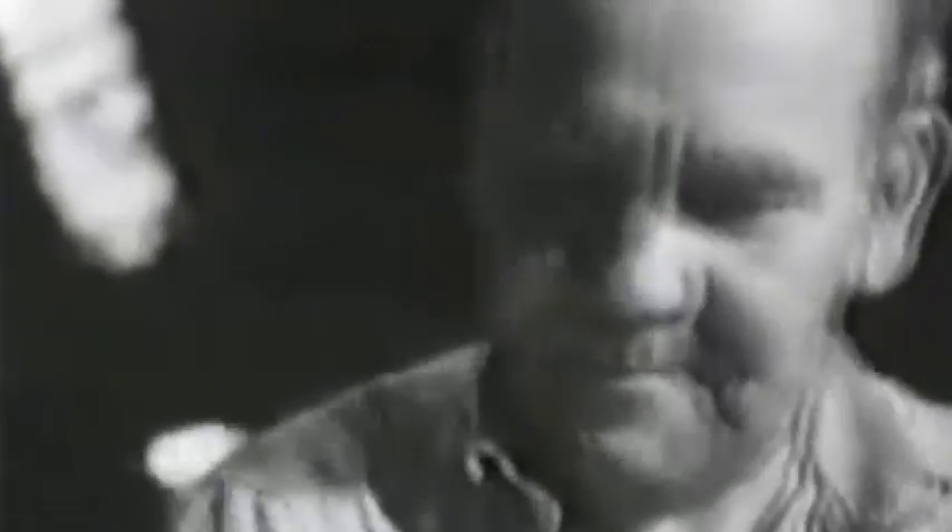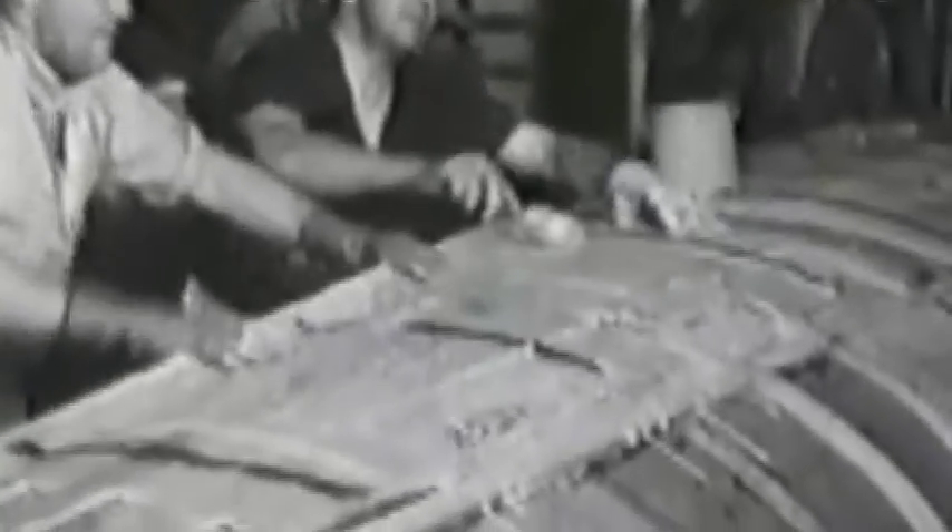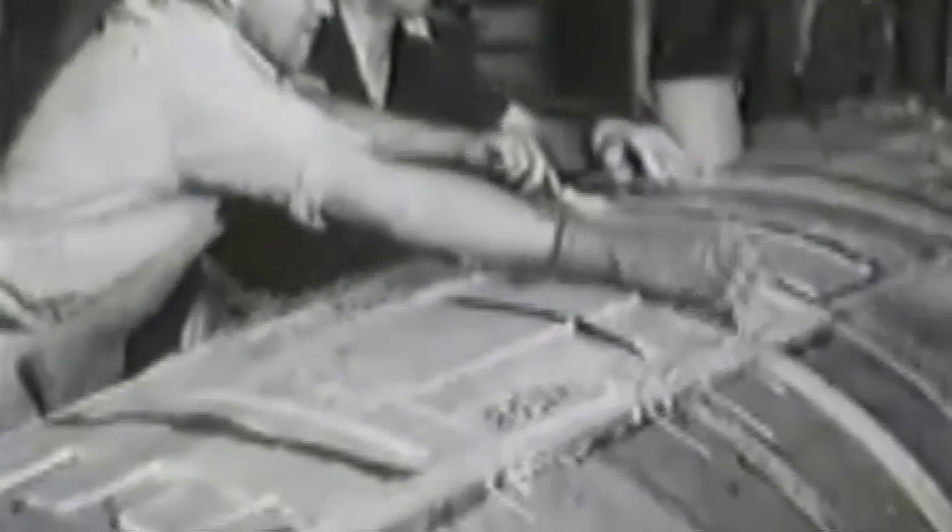From balsa wood and plywood, the fuselage is made, and these woods are held together with cold water glue. There is no metal construction on a Mosquito fuselage or wings. These bands hold the balsa wood to the three-ply, and another coat of glue joins the outer three-ply to the balsa. As soon as it sets to a hard, strong wooden shell, the bands are removed.